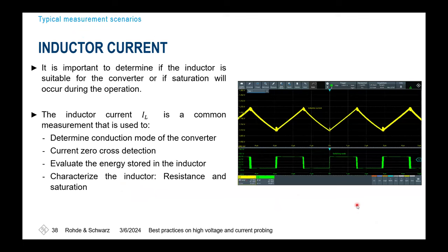In addition, also the inductor current is sometimes quite tough to measure, to see if your inductor is saturated, desaturated, or maybe also causing you some overvoltages you didn't expect there. The crucial thing here is to measure the inductor current properly. You'll have to change something in your system anyhow. So always be aware, if you're measuring something, you might cause issues in your system, especially if you'll go to the output of your inductor and you're adding a certain wire. This will change the effective inductance inside your measurement system, and thus you'll see different measurement results at the end.